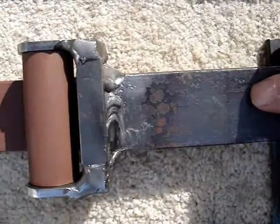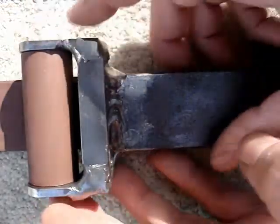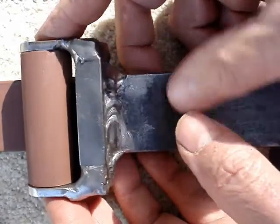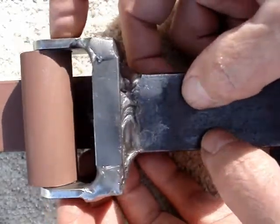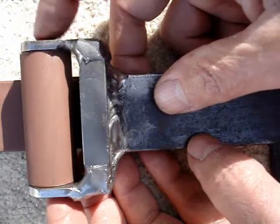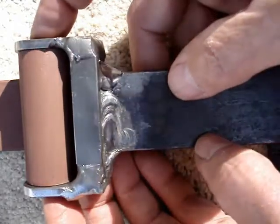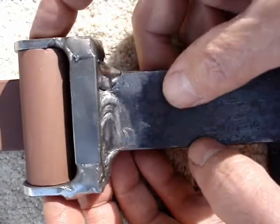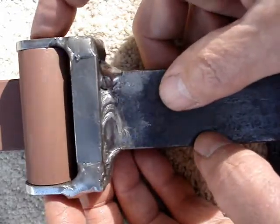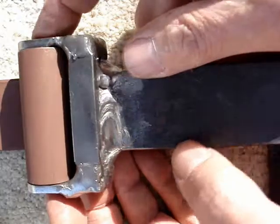When I tighten the bolt, it's going to squeeze these sides together maybe two or three thousandths of an inch, which I've already tried and it works excellent. This is three-sixteenths by one flat bar — it'll pull the sides in enough to make this be tight but still movable when I'm pulling on the approximately two-and-a-half-foot-long handle. I can swing the handle down for steering purposes and then push it back up, and it'll stay up when I'm using the welder or storing it.